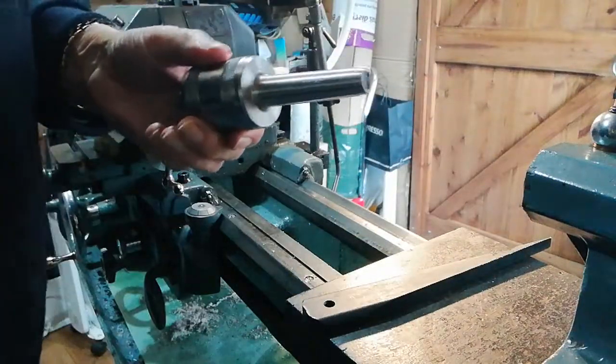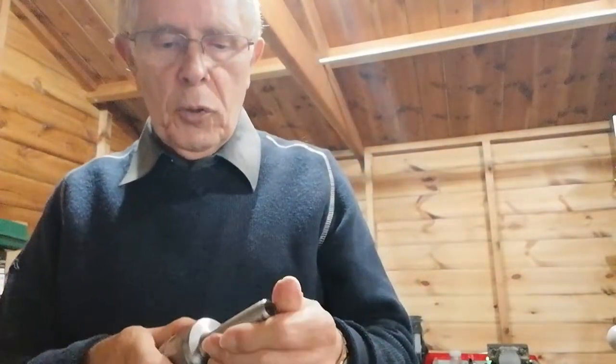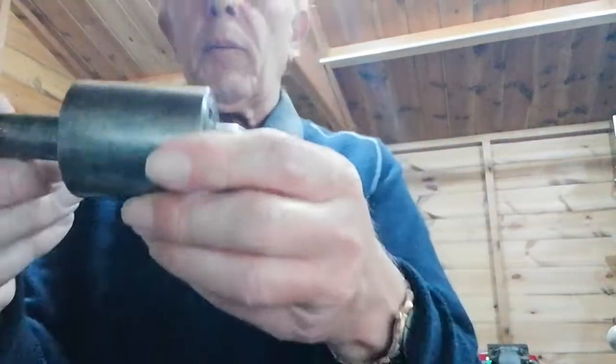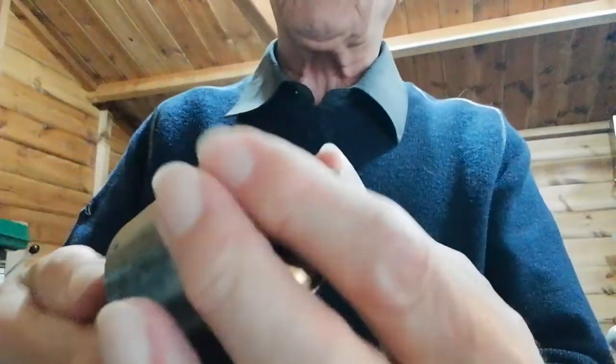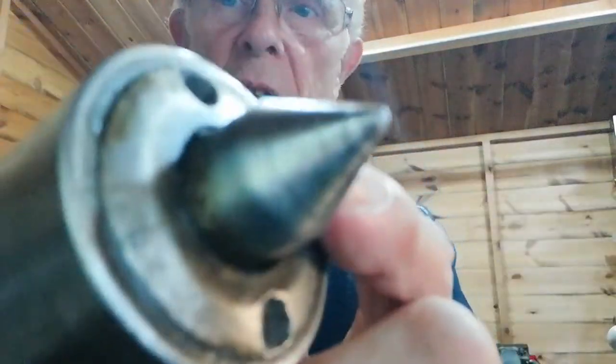So there we are — it's released, I've got it out, it's undamaged, and the tailstock is okay. The difference between what it should do with a self-ejecting tailstock — normally I would use something like one I've already got. But the last job we did was a maintenance job, and this live centre needs to be looked at because it's badly scored in there. But I'll show you how it should operate.